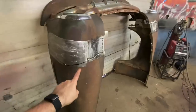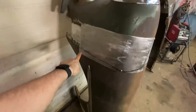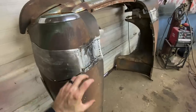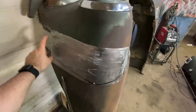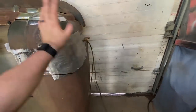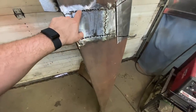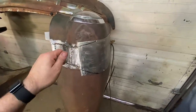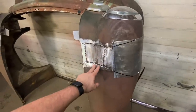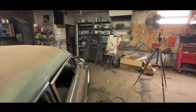We got these patches here done. We got these ones formed but they need trimmed — that's what those lines are. I will trim those so that it fits in the hole. You don't want any overlapping or underlapping; it's not the end of the world, it's just not what I like to do. I always try and butt them up as best I can. Same thing over here — this one's done, this one is marked and ready for cut. One thing I messed up on: there is a coating on the inside of these fenders. It's a quarter inch thick and I scraped it out but it's still coming out in some of my welds. Before I weld this one, I'm going to really scrape that out — I might get a torch and melt it because as I'm welding it's heating up and running down. It's like a super thick 70-year-old undercoating, and it is on there good.